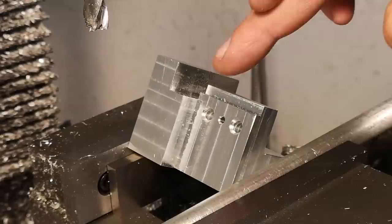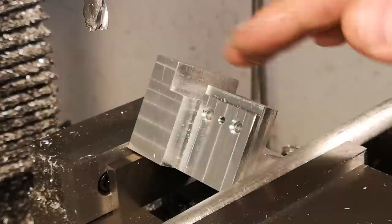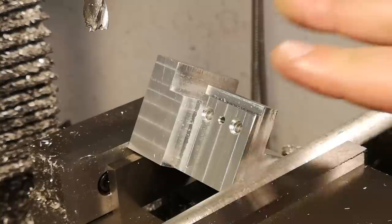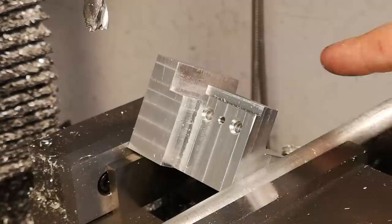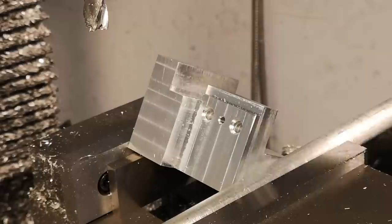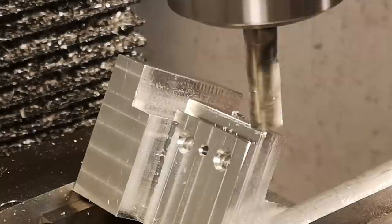If you're a purist you're going to hate this, but hear me out. I want this little dovetail angle to be normal to this face here. So I've used one of these little angle things underneath, and I'm using the dowel-on-the-moving-jaw trick to push this up against the fixed jaw while it's sitting in this angle. I'm hoping that makes this plane normal to this plane, which is what I'm mostly concerned about. I'm also just going to eyeball the depth — I do have some adjustment. I just need to make sure I get that 60-degree angle. I cut this shoulder here, and I defined these dimensions, so it really should just be straight across.